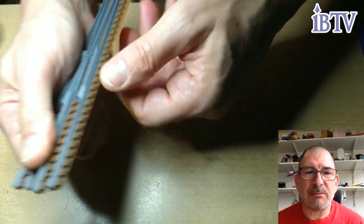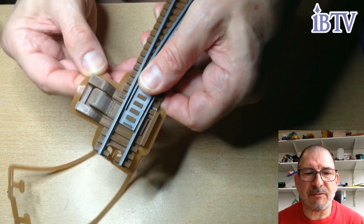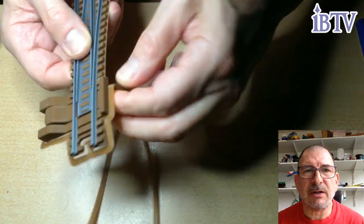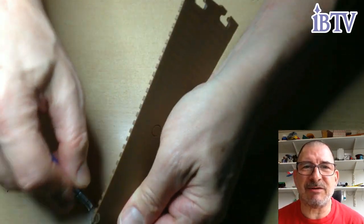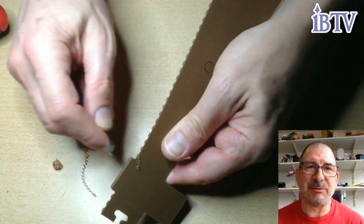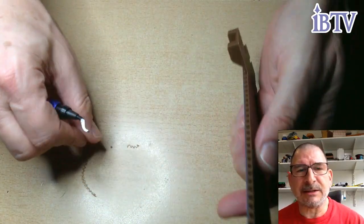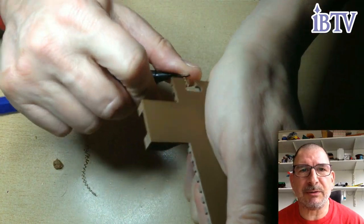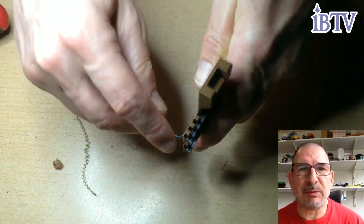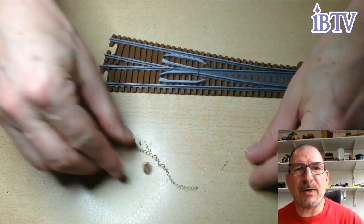After printing, I use a brim with a 0.15mm brim edge setting. Some brims are easy to get off, some are harder. I find that with the brim I haven't had any failures, whereas I've had a couple without it. Since it takes about seven minutes for the Bambu to get going, I'd just as soon put the brim on and take it off. I use a deburring tool — there are two kinds: a normal pull deburring tool, which is sort of right-handed, and a push one, which is essentially left-handed. I like to use the left-handed one to remove the brim cleanly.